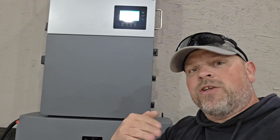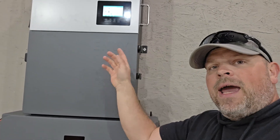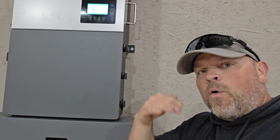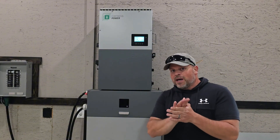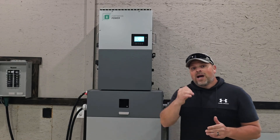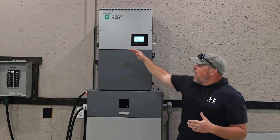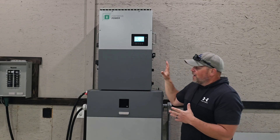Wow — it actually overproduced and that didn't trip! So I'm good with that, but I am a little concerned. Glad that it came back off of that just a tad because I'm running this as pretty much an extreme test and I don't want to overdo my wiring going into my transfer switch, but it certainly did reach that 12,000 watts of output. I'm running it right around 11.8 kilowatts and I've got to back off testing just a little bit because I'm starting to get concerned on the 50 amp breaker — I'm seeing right at 150 Fahrenheit, 146 Fahrenheit on that breaker, and that's concerning to me. So I'm going to bring this back off just a little bit and continue the testing.